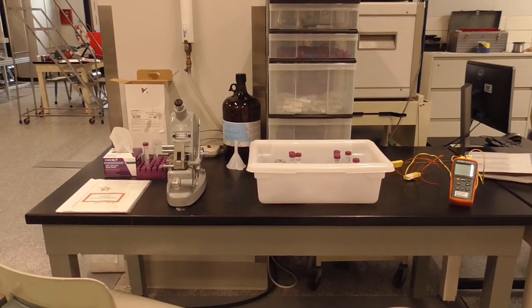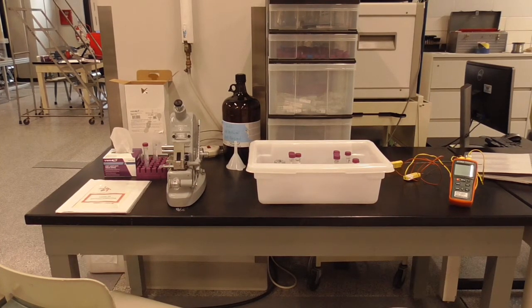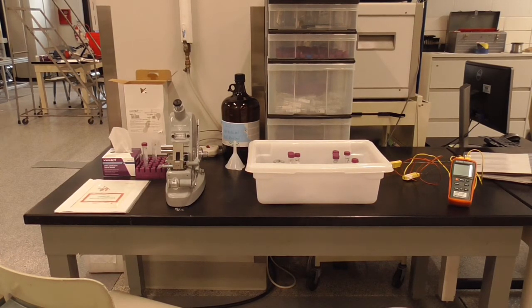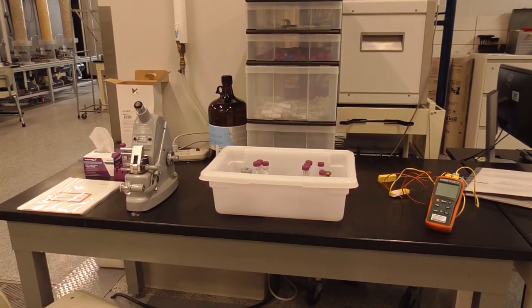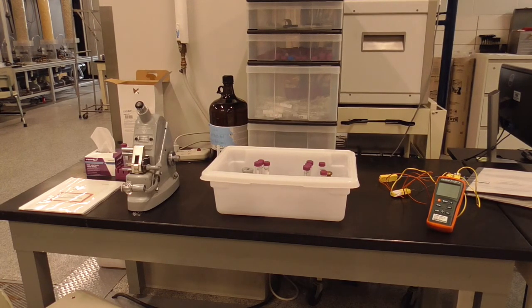This is the station where the second operator will sit 6 feet away, reading the index of refraction of the samples. This job is kind of easy but a little tedious, and you have to decide when you're at molar equilibrium. Because the operator on the column is so busy with material balances and sampling, this operator, in addition to reading the index of refraction, will make any feed that might be needed in the course of the lab. I will have the feed tank stocked with an initial stock of 50-50 feed, but if you run through that, then you'll need to make a second or third batch.